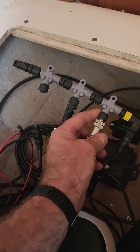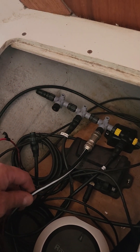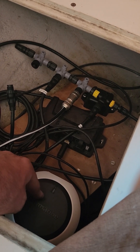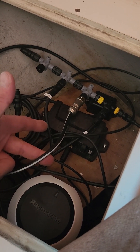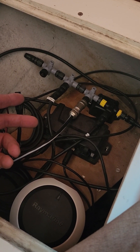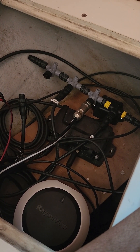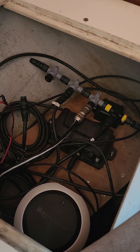But there's another splice. You can see you need the male connector version for this side. And if you encounter a situation where you want to make your own cable, you need the female side to go to the actual units themselves — this is a SeaTalk NG plug. You use the cables that come with the kit, cut them, and splice them according to the pinout diagram on that Amazon listing. I'll leave a link to the Amazon listing below. If you guys want to do the same thing, leave comments down below and I will try to answer every single one. Thanks so much.